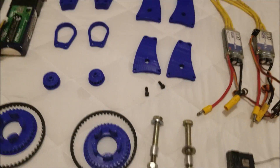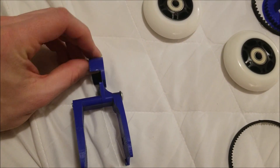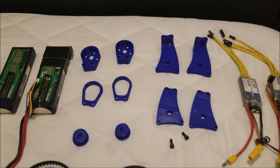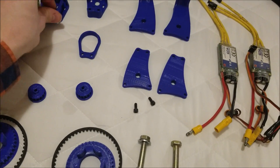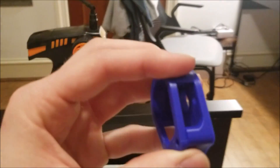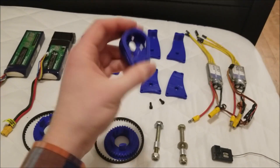One fault with the last design was the motor mount — this piece actually cracked because I have the motor on the right side and the belt on the left side, and the belt tension was pulling it, eventually causing it to crack. I wanted a 3D printed design that could withstand that force without CNC machining the motor mount. So I came up with a support guard that fits inside the motor guard like a cage, supporting it on both sides so it doesn't flex as much. I tested it under load and it worked pretty well.